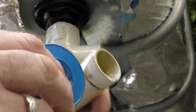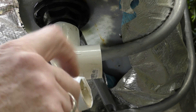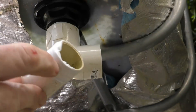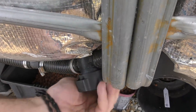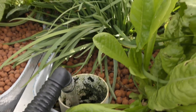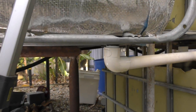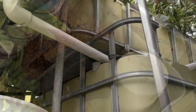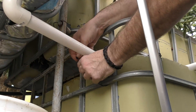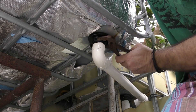That looks to be all right. I'm just wrapping a little bit of Teflon tape around the end of this drain fitting, and that will help create a watertight seal between it and the elbow there. I like to wrap a little bit of the tape over the edge — it just helps it to not pull back when you pop it into the fitting. So I can turn this valve on now into the grow bed. It's a little bit faster than it normally would be, and that'll fill up. We'll be able to see if we've got any leaks down the bottom. There's nothing coming down yet, so we'll let it run through a couple of cycles and then put the clay in, because the last thing I want to have to do is dig all that clay out again. I just zip-tied the drain down a little bit, just to give it a little bit of a downward run towards the sump tank. I did have to tighten up the bulkhead fitting here — there was a little bit of a leak, but nothing a couple of spanners couldn't fix.